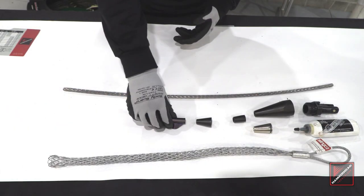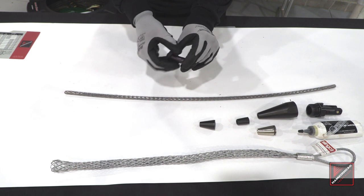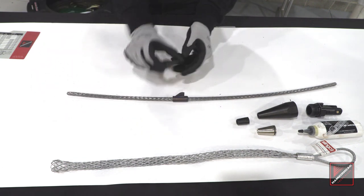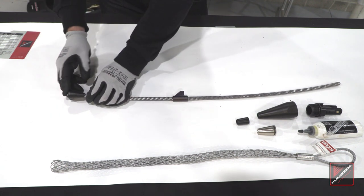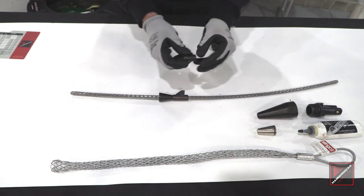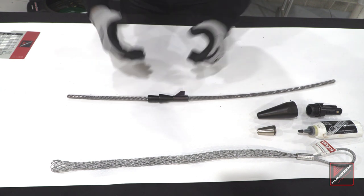First item we're going to put over the cable is this blade. It has a tapered end and a flat end. A lot of guys want to put the tapered end towards the lead, but this is not the slitting surface — we want the sharp flat end facing towards the lead pipe. So we'll go ahead and slide that over the cable. The next item we'll be sliding on is the smaller expander cone. This cone does a little pre-expansion work as I mentioned, and adds distance between the slitting and expanding forces, making the overall load required to finish the job less. Next up is the separation tube, which similarly adds more distance between the slitting and expanding force, giving us a lower tonnage overall.